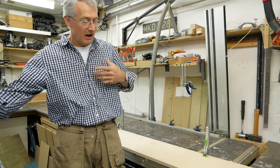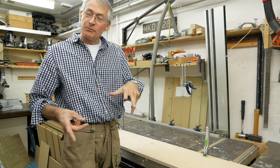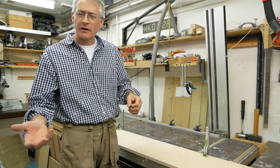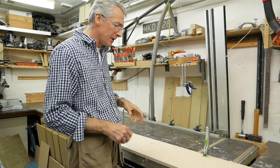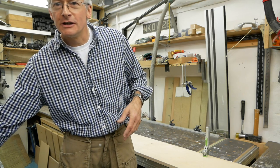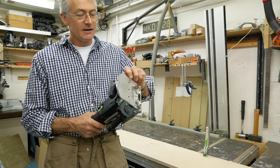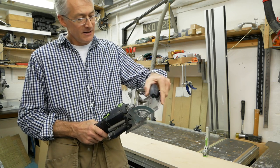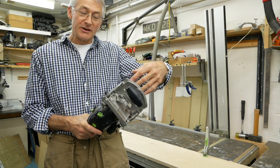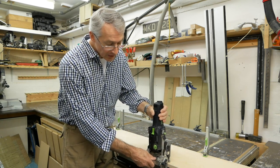You could use a jigsaw — it's too big for a band saw and I don't have one — but how do you protect the top surface from splintering unless you use a down-cut blade? Every time I use a down-cut blade they seem really, really slow; they almost burn their way through. Maybe I just need some new ones. Then it occurred to me that I've already got the perfect tool for this. I think of it as a loose tenoning machine, but Festool's Domino is actually a slot mortiser — that's what it does. You can vary the size of the slot, the depth of the slot, and the distance of the slot away from the fence, so using this to cut that back slot will be perfect.